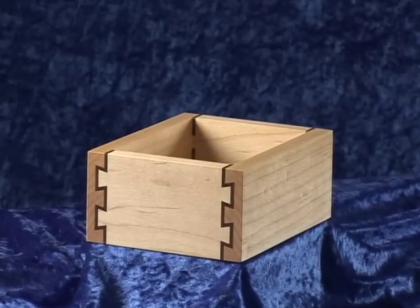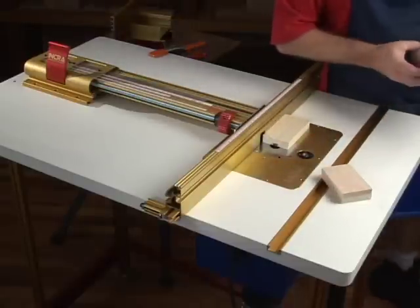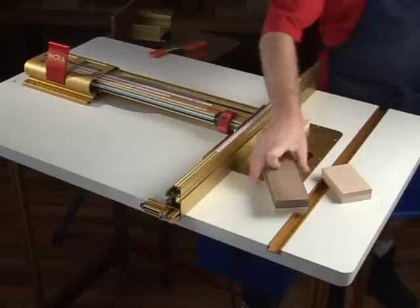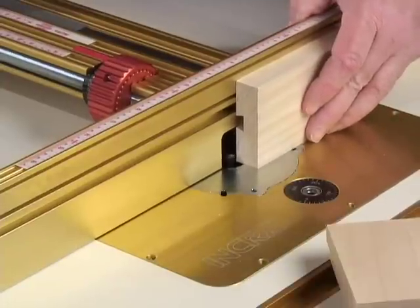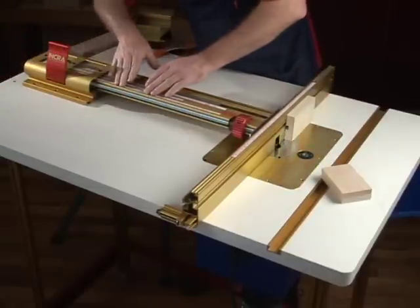For this decorative joint, we're using the IDDD template with 6C as our center cut and 2 5/8 inch stock. You'll need 4 pieces for the box sides and 1 piece of 3/4 inch contrasting color stock about 8 inches long to make the decorative trim section. Set the fence to a scoring pass position and slide the Lexan measuring scale to read 0 under the cursor.